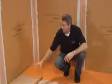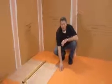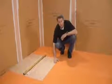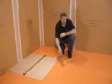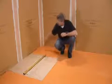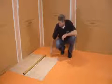Okay, we've installed the tray, the channel support, and the drain body. And now what we've done is we've established an elevation out on the rest of the bathroom to flush out with the thickest part of our tray. We've also put down the Ditra, our uncoupling membrane, which we're going to use for waterproofing now. So we're going to treat all the seams in the Ditra and flash onto the floor-to-wall connection onto our KERDI board, and then we'll continue by tying the tray into the Ditra with some KERDI band also. So that's next.